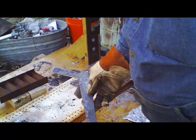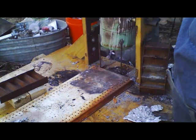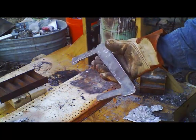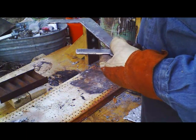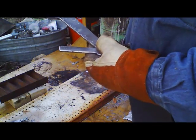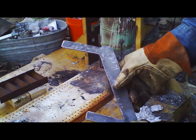Here's another gadget that you're going to have to build. It looks weird. What it is, is a handle lock. You slide it into the two handle holes in the back, and it locks the lid to your body when you're pouring. I can't make you one in advance. The reason being, you've got refractory sticking up from the body, refractory sticking down from the lid that you're going to contour. I've set a gap of a half an inch, but you might have five-eighths or seven-sixteenths. That gap is going to dictate the dimensions.